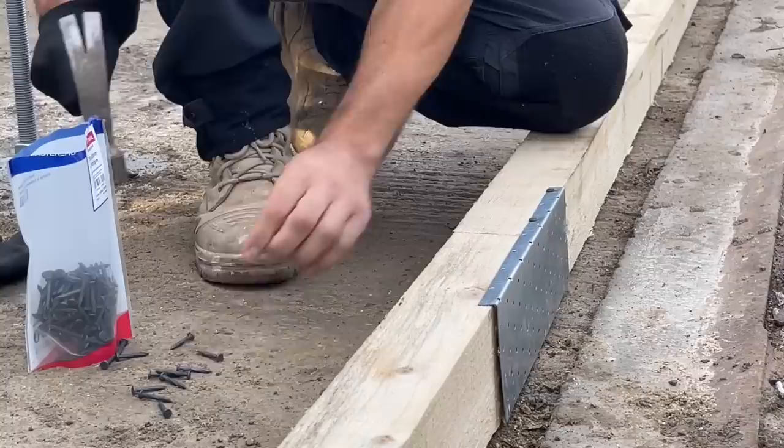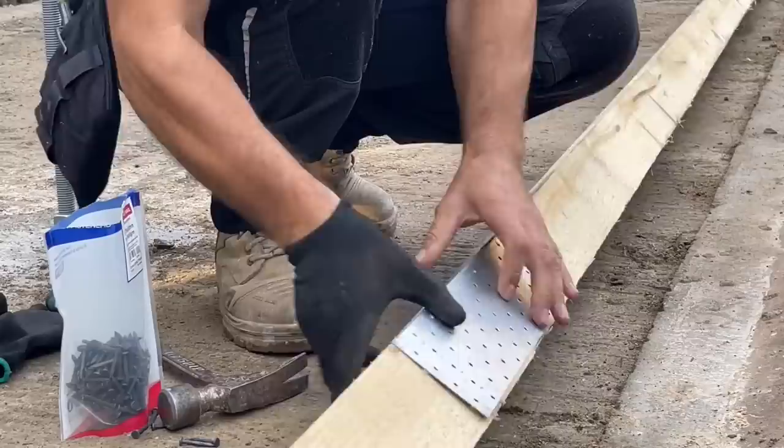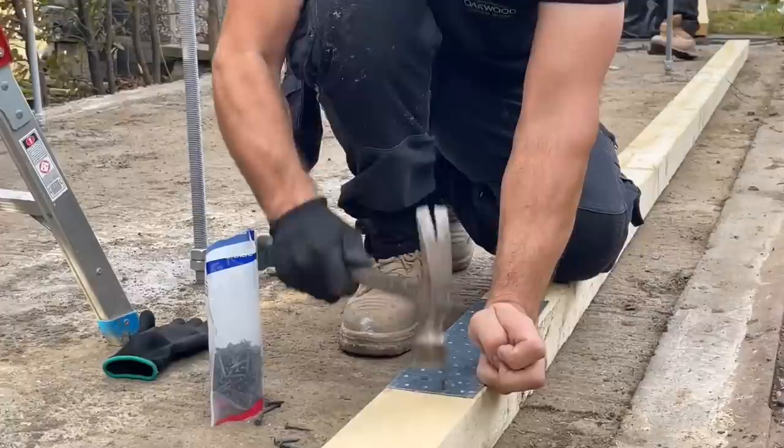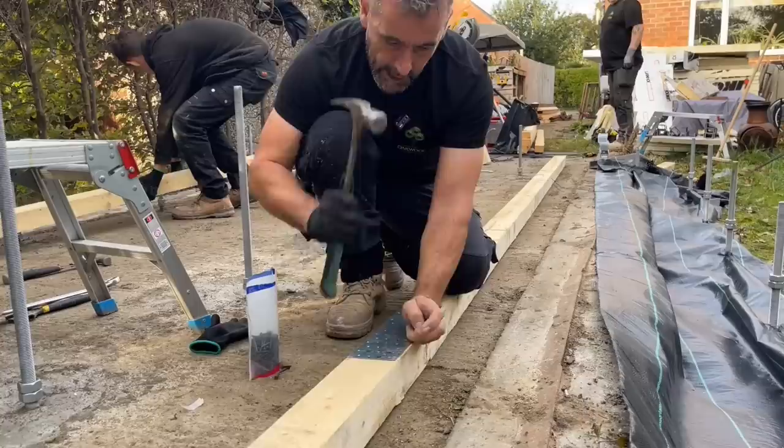I will buy a PPN nail, I keep promising, don't I, John? Yeah. That's going to happen. It's just at the moment, I'm not 100% sure if it's cost effective because of the cost of the nails. So what I'm going to do, I'm going to keep nailing that. I'll nail every other hole. I'll put a splice plate on both sides and that will then join them 4x3s to make them long enough for what we actually need. And then we're going to drill them with a Milwaukee and I'll show you that drill as well.